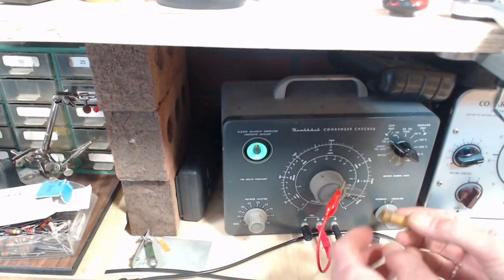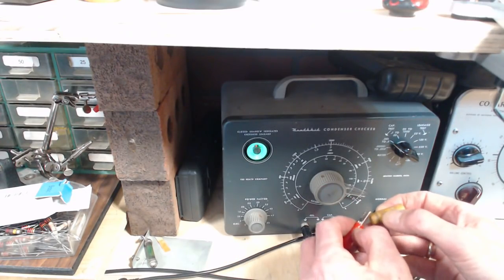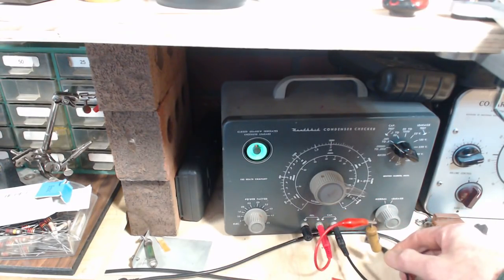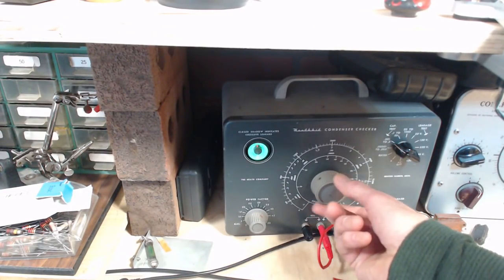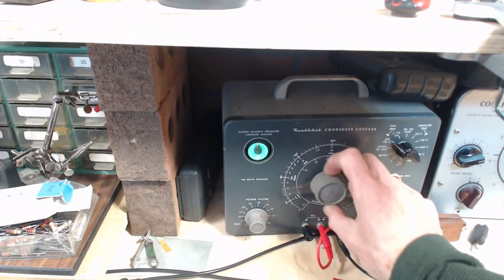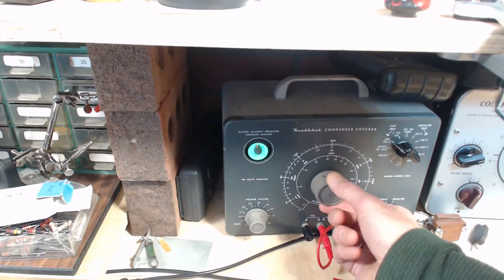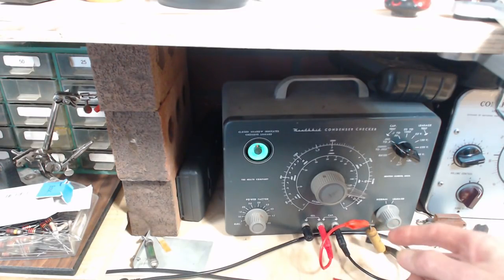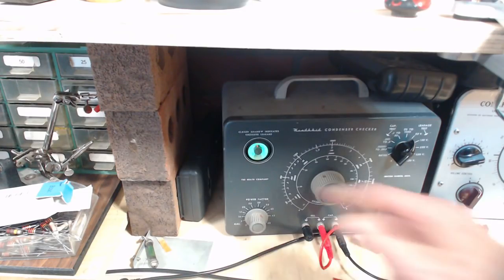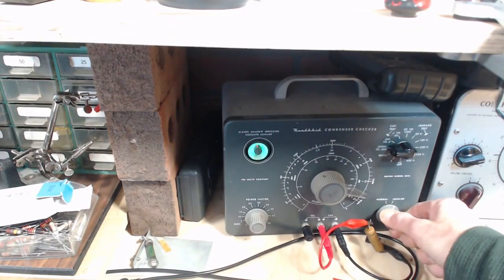Okay, now here's the same size capacitor. This is really in good shape. So before trying the leakage test, since we're right here, let's test it right on here. I'm getting the very same effect. It's not really popping open. I know you can't see it on the video, but it's right in the same spot. Okay, so we'll do this on the leakage test. You can see it's open. Beautiful. 250 volts. Nothing wrong.